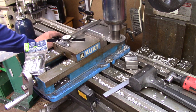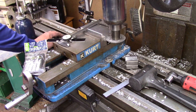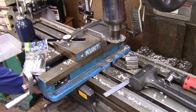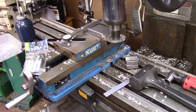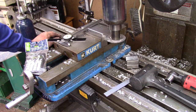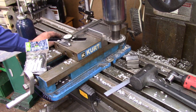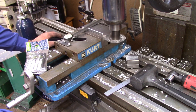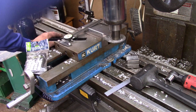You have to be careful, these arms are grabbing. We're just trying to feed this to a 1/4 inch. We're feeding a lot of feed. We're putting a little bit of torque on the table there to help. I'm just feeding the whole 1/4, see how it turns out. What it's doing is actually slipping on the arbor just a bit, which is not a bad thing. We might have to turn the speed up just a hair. Let's try that.